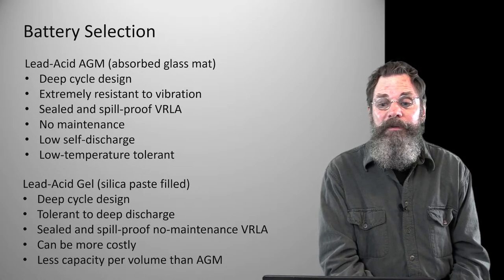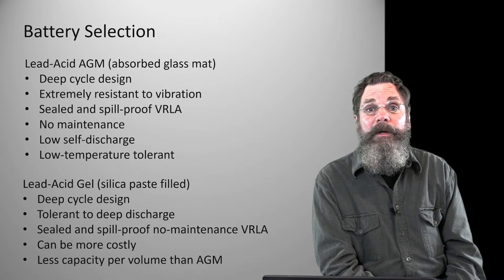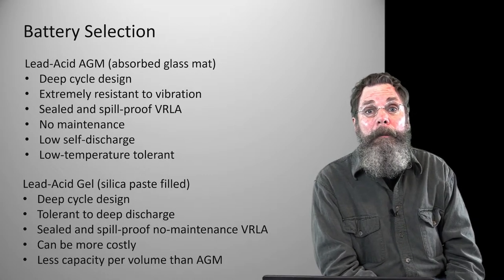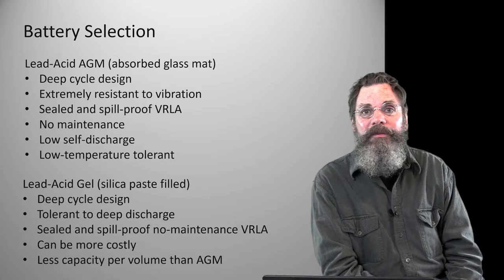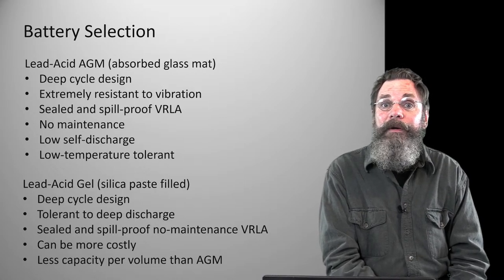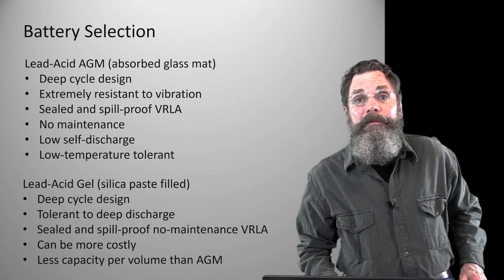We also have other factors to take into consideration, such as the physical size in comparison to the amp hour capacity. If you're getting a small battery with a very high amp hour capacity, that's wonderful. If you have a very large heavy battery and the amp hour capacity isn't all that great, that's not so good. And fitting a block of plastic and lead case into a box is going to take a little bit of geometry. You have to figure things out: turn it this way, turn it that way, shove it forward, pull it back. Can you stack them one on top of the other, make a little shelf? Can you turn two in one direction, three in the other direction, all that kind of thing? It's basically a matter of arranging furniture in a floor plan.